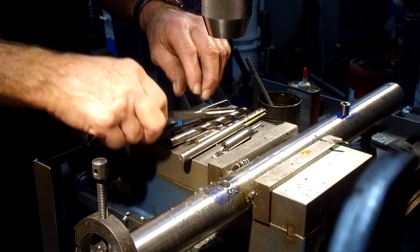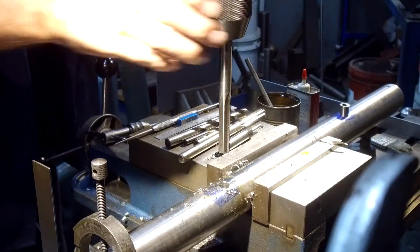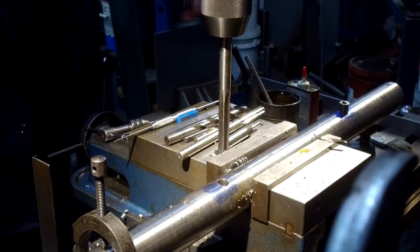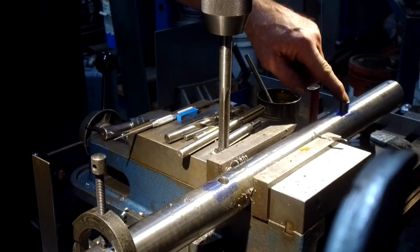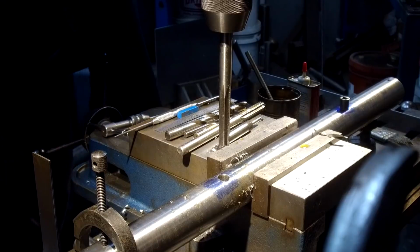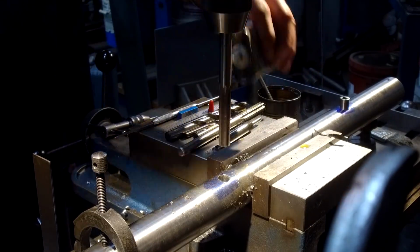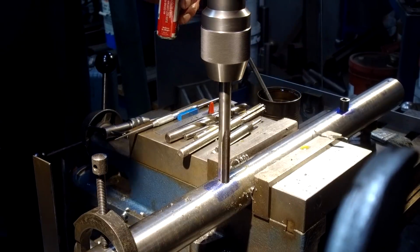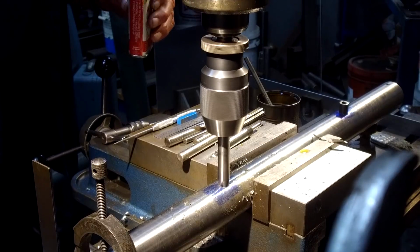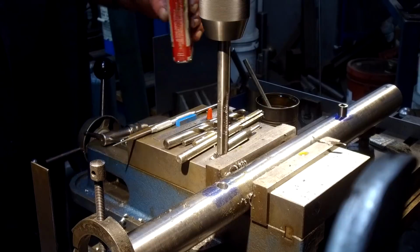Now we have an old reamed hole. Now we're going to have a new reamed hole. This is a new reamer, and this reamer really made this one fit tight. This was a little too tight with this first hole. After I went down with a reamer on the second hole, I had good fit on my sleeve. I mean, it's barely taking anything out of there, but it does take a little bit.